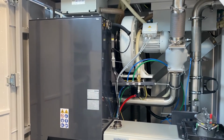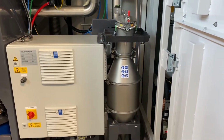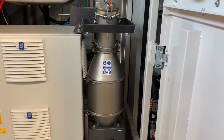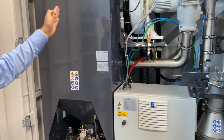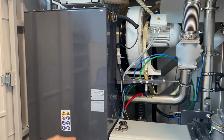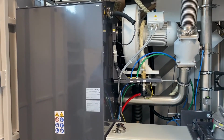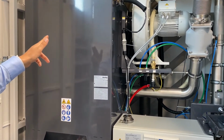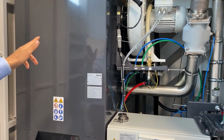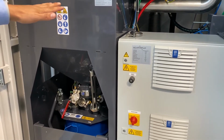The limestone material is stored in a separate container and is continuously and automatically fed by the system. This results in a layer by layer buildup of metal condensate and limestone on the filters, which results in an intermediate passivation of this reactive material. As soon as a critical coverage of the filters is reached, the filters are cleaned automatically. The printing process is not interrupted by this.